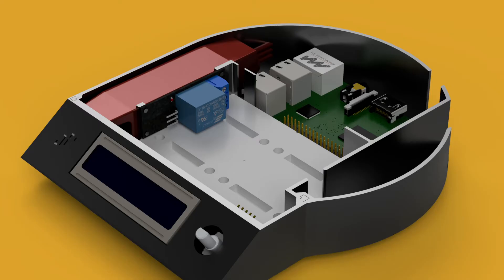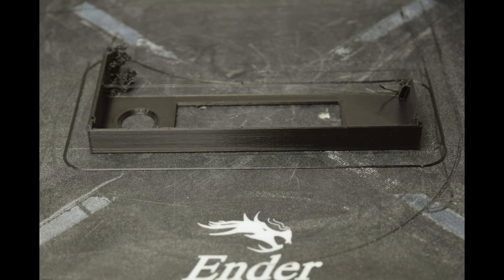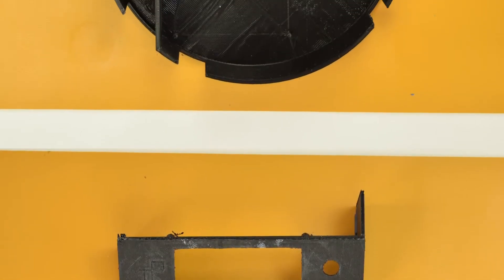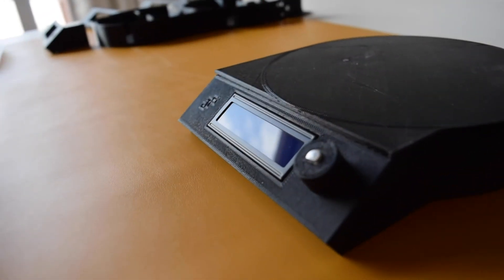We could have gone the PCB way — designed a board, all that kind of stuff. The design consists of three parts: main, front, and cap. They are all made of plastic. For simplicity, no fasteners have been used — only slider joints between the plastic parts. Let's get this printed. Here are the time-lapses of the printing of the three parts. What makes 3D printing so amazing is the ability it provides to fail quickly and iterate on it. As you can see, we've been through a couple of designs before finding the right one and doing the final assembly.